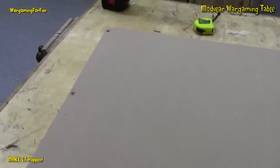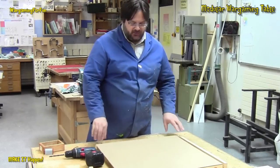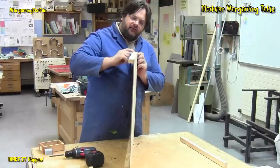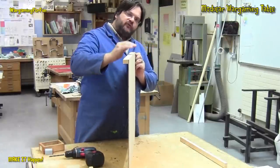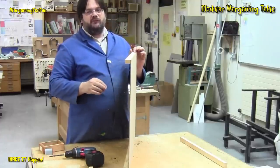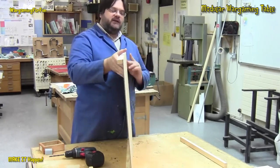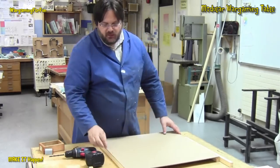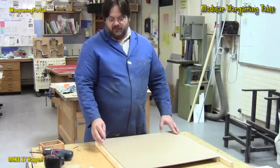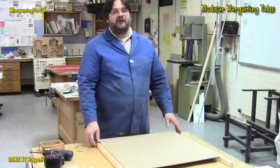So there's the board so far. I'll put those screws in. The thing to watch out for when you're putting the sides onto the boards is that the pine here doesn't stick out further than the MDF. You can probably get away with it if you're a few millimetres out, but not if the pine is sticking out. The reason is that when your other board comes up to it, it needs to go straight to it, and if it's sticking out it can't, and you'll notice it will spoil the effect of your table.